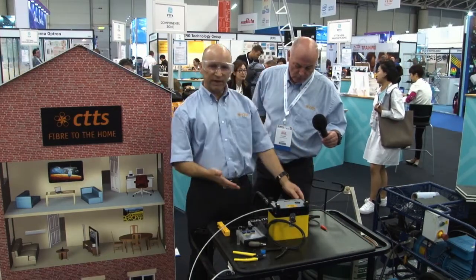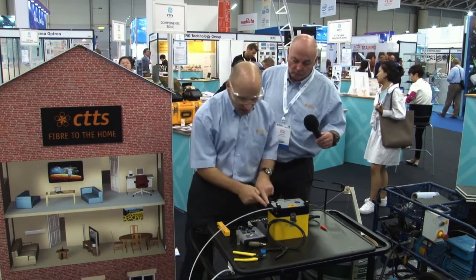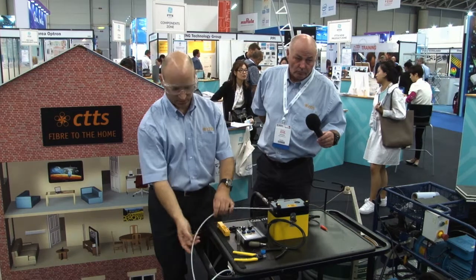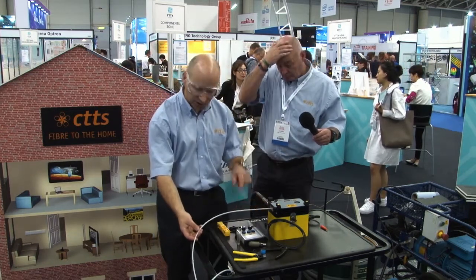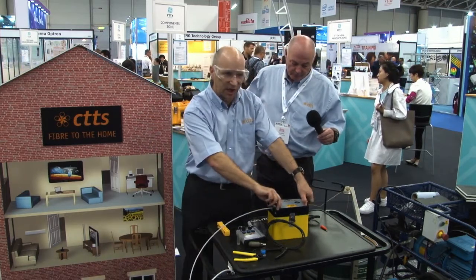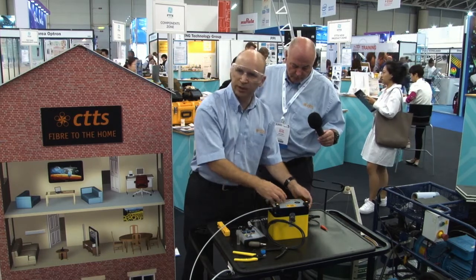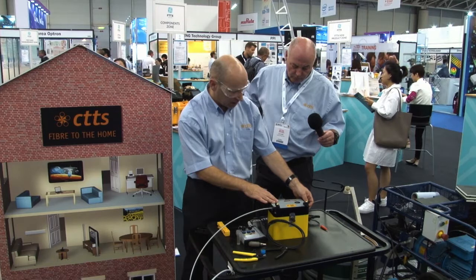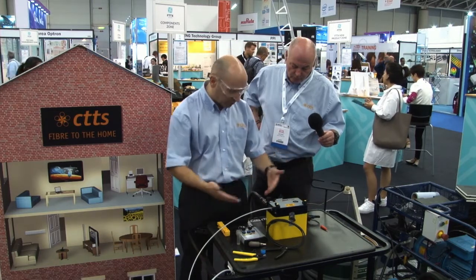As I close down the lid, I've got to keep the pressure in the machine, and I want the majority of air running at about a maximum of 10 bar for this demonstration to run through the tube and not to escape out. So I need a tight connection on the lid, but not too tight. So I just test the fibre by pulling back a few centimetres, and I'm happy that the whole thing is moving.